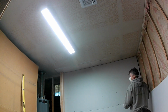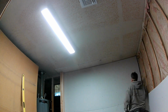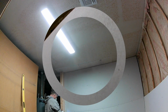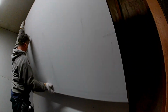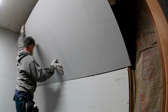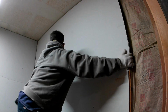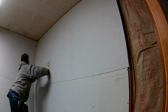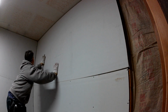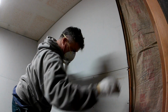And we got the walls insulated to the exteriors. And then, of course, you don't need to insulate your interior doors or interior walls, because what are you insulating? You're just trying to keep the heat in the same room. So some people like to insulate interior walls maybe as a sound barrier, but if you're paying for it, really, you're not going to get anything out of it besides sound.